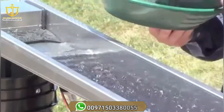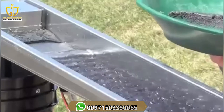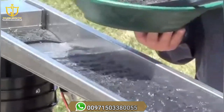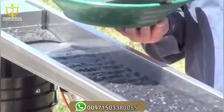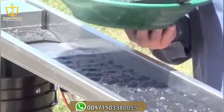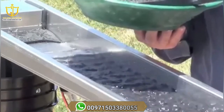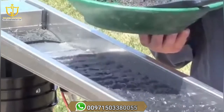Question: how many pounds an hour can you run — say like a five-gallon bucket? We're running two five-gallon buckets in about two hours once we've classified the rocks off when we do dredge cleanup. So that's concentrate from a dredge. And what you'll end up with in your sluice is all your gold, all your lead, and any other metals from your dredge.